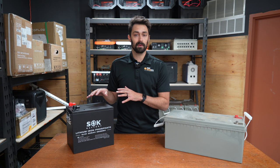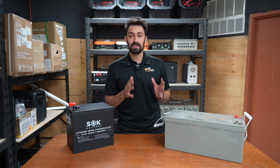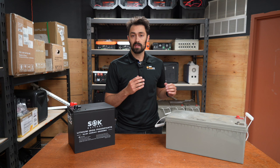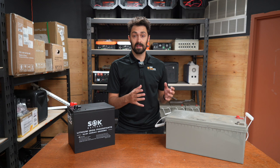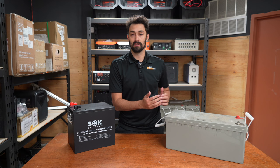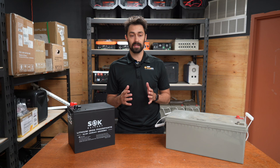This is a high-level video, and we have a much more in-depth discussion — even a full course on batteries in the Solar Hub — and I'll link that below if you want to check that out. There are definitely situations where an AGM battery makes sense. If price point is your main concern, AGM batteries are a perfectly fine option. We've been using AGM and sealed lead acid batteries for years, so it's a shorter-term solution that can get a system up and running. Another area where AGMs do better than lithiums is in colder climates — if your batteries aren't insulated or kept warm, an AGM or sealed lead acid battery is going to be a better option for you.